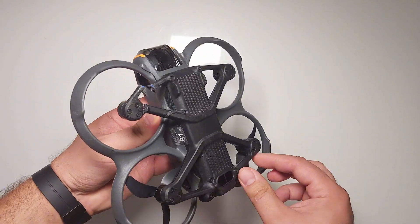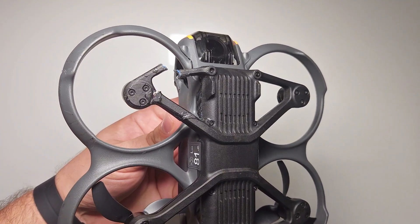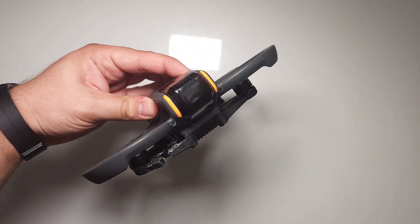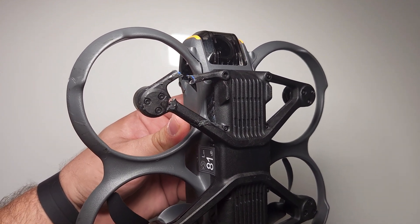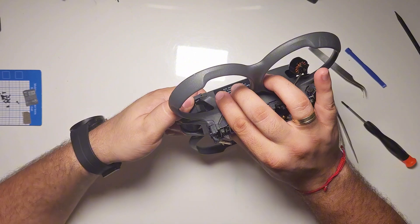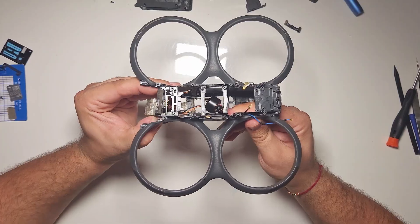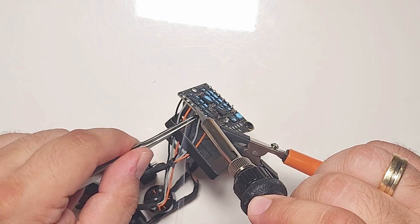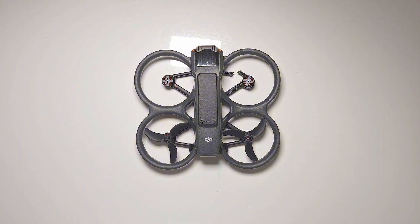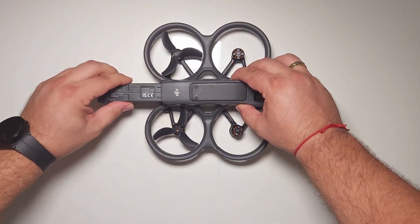Hello guys and welcome to today's video where I'll be repairing this DJI Avata 2. Both front motors and the frame need replacement, and to make matters worse the entire bottom frame was absolutely drenched in glue, which made the disassembly even more difficult. I'll show you how you can replace your camera, the motherboard, the ESC board, or the motors. At the time of filming there are very few spare parts available, but I was able to find motors and the bottom frame. You can find links for the parts in the description below. The first step as always is to remove the battery.